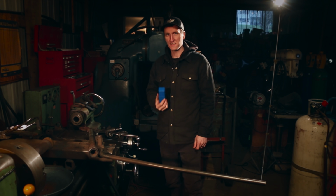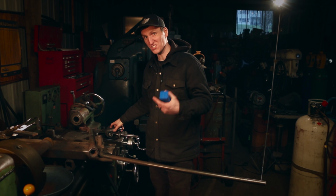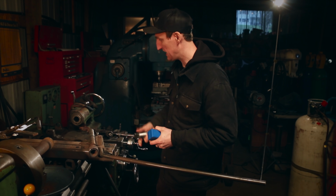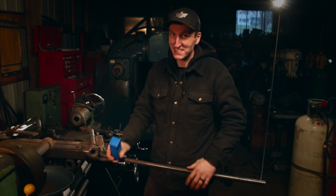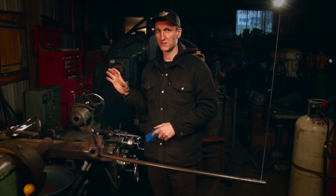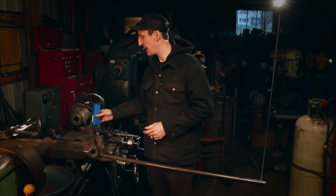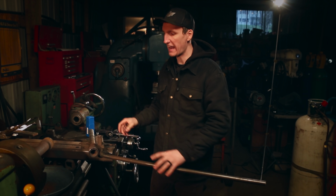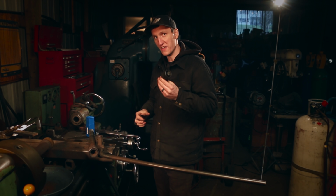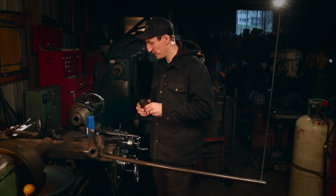So I just got this in the mail. What was going on, it's a new day, is my live center got cooked from the heat, right? I know how bad this is on the lathe. Putting this much heat into it, it's brutal. When I first started doing this in 2015, I had a little bit better of a heat shield setup because I actually did like 50 of these things. My live center was this one then, and it burned out, but it actually lasted pretty long.